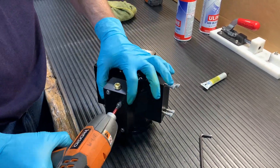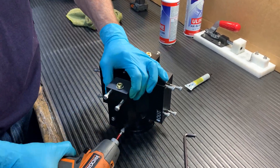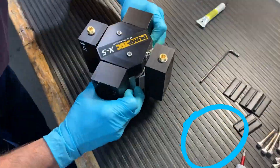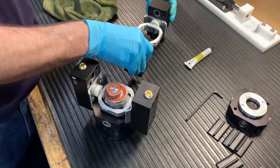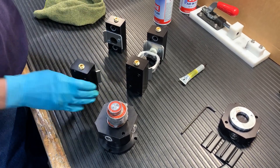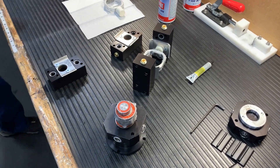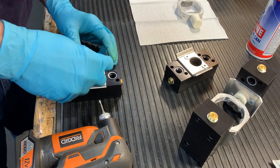So let's take apart our pumps. We'll use our 5/16th hex wrench and loosen each of the 16 bolts that secure the heads to the manifolds. We'll grab our drill to speed up the process. Gently pull our heads apart, just enough space to get that manifold off, and we'll place that to the side. Then we can take off each of the TIE fighter-looking heads and plunger constructs. It's important to know what you are going to replace. If you're just going to replace the heads, I would recommend only taking off the heads and only doing one at a time, so you don't get confused on how things go back together.